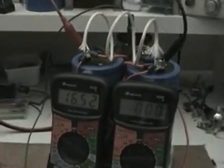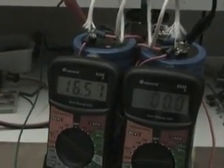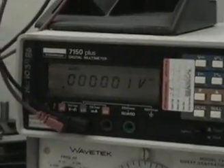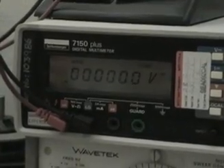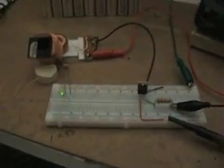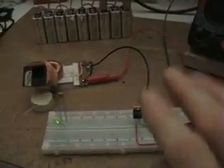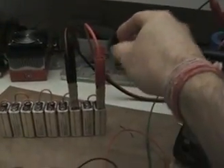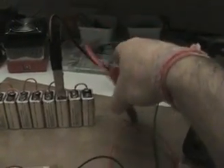This is energy that one would be capable of picking up from the toroid coil. The circuit is calibrated and adjusted at this time from the source voltage of 16.5152 volts. If we look at our precision meter here, we're picking up no current, so the circuit is calibrated to not send or spend any current. We still have our battery connected, so we can disconnect it now.